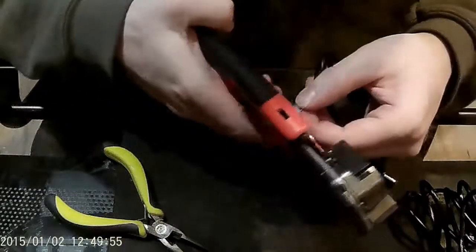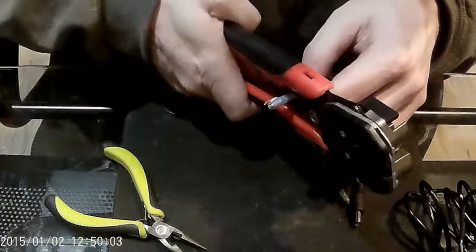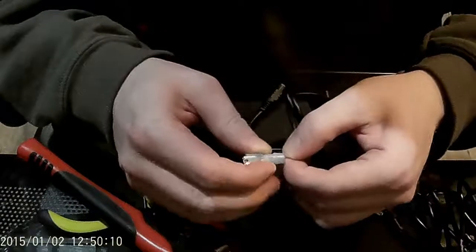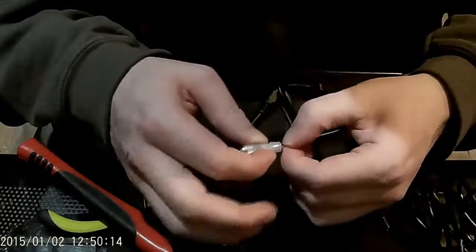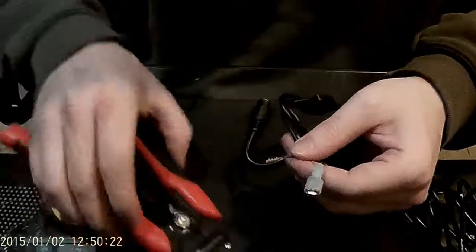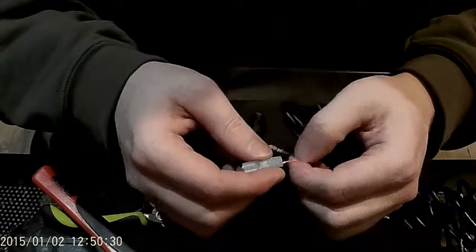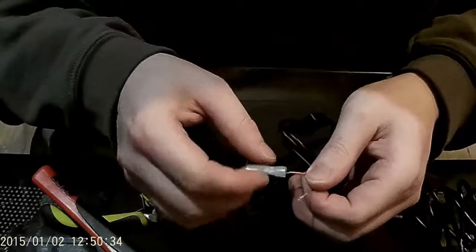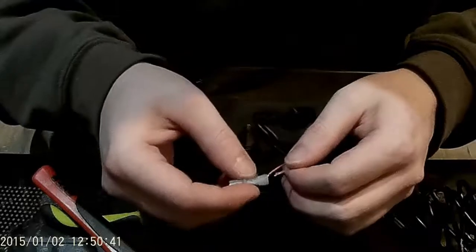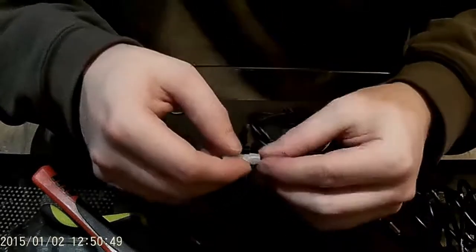This part just takes some time — you know, take time to figure out how to crimp stuff. If you have an electric crimper, that's always good too. I like to crimp by pushing it down and making sure it's nice and tight. Then pull on that wire just a little bit to make sure it's snug and won't just pop out. On this first one I've left a little bit of extra wire with the braids hanging out — I'll probably redo this, because you don't want any copper showing after the crimp. If that touches something, you could see a short, and if you have a metal case you definitely don't want that.